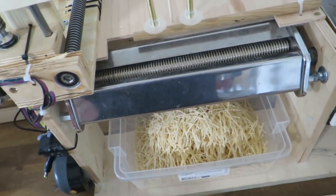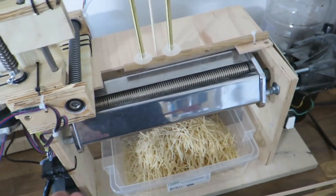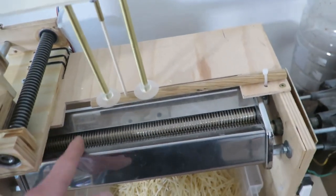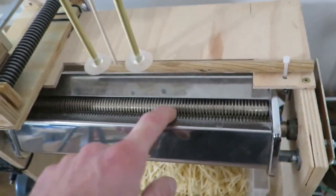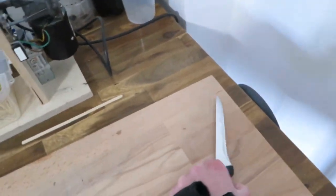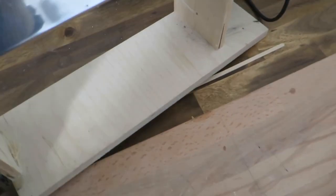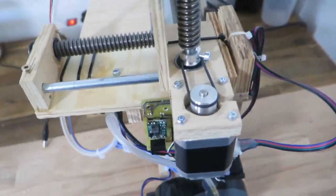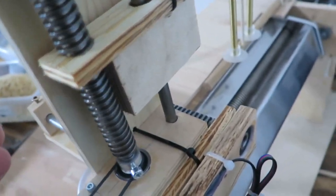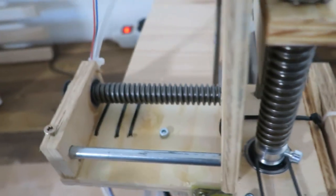So, I didn't want to talk while this machine is running because it's relatively loud. But you can see that the process can be probably still optimized quite a bit. There is a lot of dead time when this cutter is not cutting. And it's probably a good idea to show you the design of this manipulator, which is two Acme screws, or in this case metric trapezoidal screws, but anyway. These are driven by stepper motors.